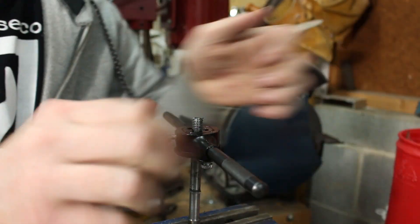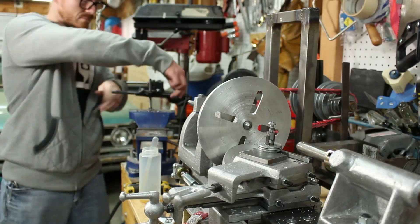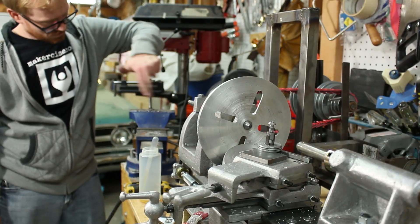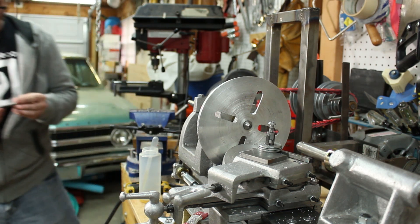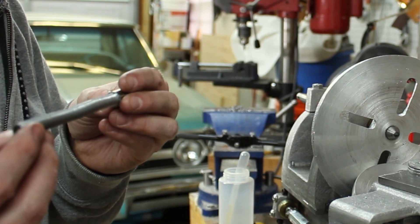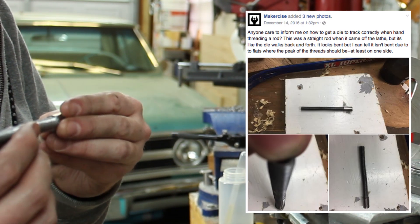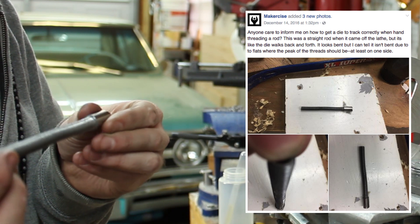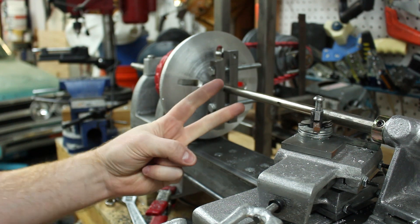After I put the crowns on the pulleys I threaded the tailstock ram feed screw. I did it just using a die and I ran into some problems because I was trying to get the threads all the way to the bottom. I flipped the die around and that caused it to get all squirrely. Fortunately the folks on Facebook helped me think through the issue and I went ahead and got started with round two.